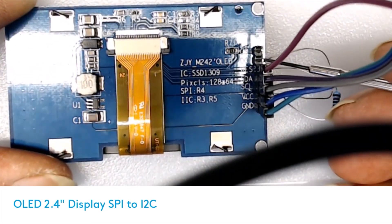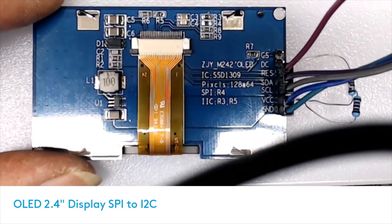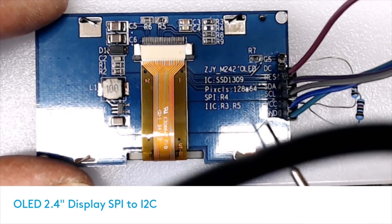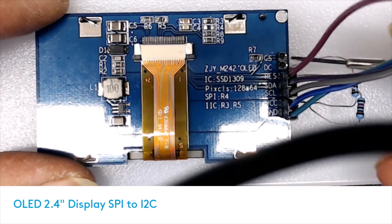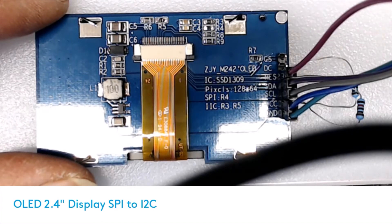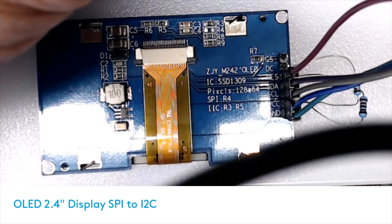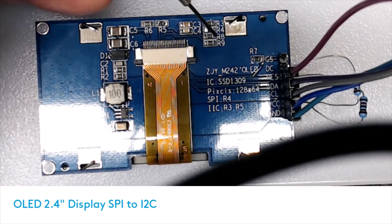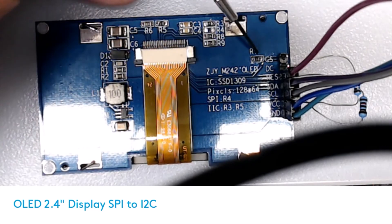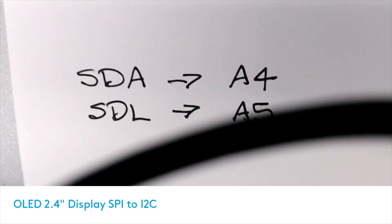You don't need to connect anything else to DC. As I understand it, DC is the pin that selects the I2C address of this display, and as I've set it up here the address is 0x3D - I'll put that in the comments. So to recap: you remove R4 and you short out R3, R5, and R7. The reset connection doesn't take one of your IO ports since you're connecting to the reset pin which isn't usually used.